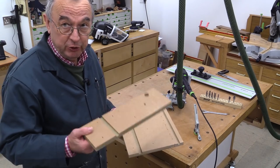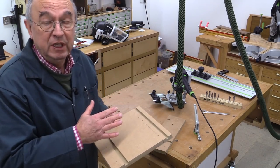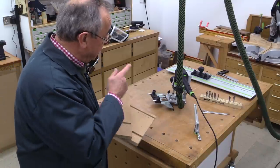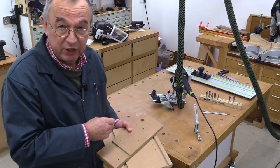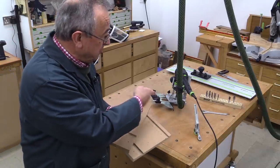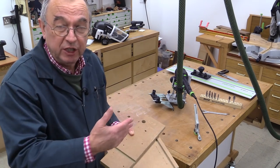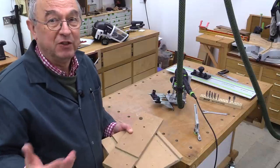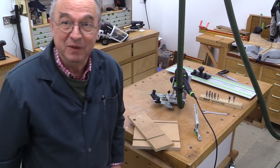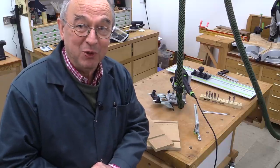So there we have three different ways of going about trenching. You can use your mitre saw up to a certain width of wood, and then beyond that you can either use your track saw with the cutting station or MFT3, or finally you can use a router. The OF-1010 router I've just used is my go-to router — it's got a quarter-inch chuck, and I've standardised most of my cutting with quarter-inch shanked professional Trend cutters. My track saw cutting station was made with the Parf Guide System so it's super accurate. And my lovely Capex saw has given 10 or 11 years of absolutely brilliant, faultless service — I've had the blade sharpened a few times of course. Many thanks for watching.